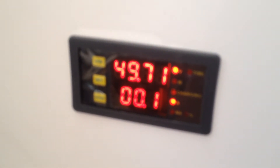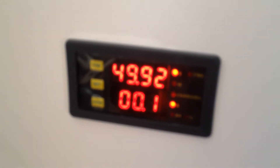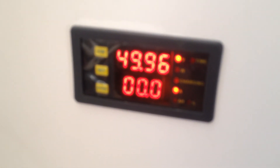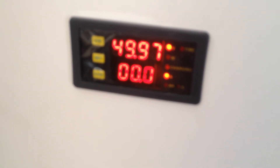We're just about there, so it's quite safe — there's no heat involved, the current is minimal. As you can see, the globe's no longer glowing, but it's providing a resistance path for the current. That's the important thing — some resistance to slow the current down and maintain a low current charge of the capacitors.